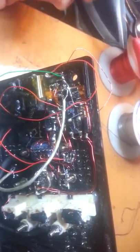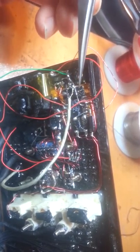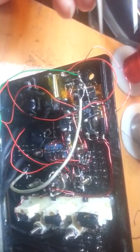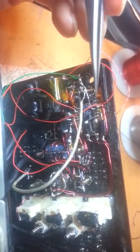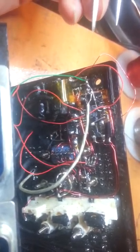The chip is buried under some wires here — I built this to a very small footprint. This right here is a parallel resonant crystal, a 3.579 MHz crystal. It sends timing pulses — the frequency — to this chip to produce what's called color burst, which gives color to a composite video signal for NTSC. For PAL, you just use a different frequency crystal.